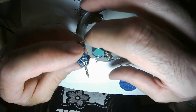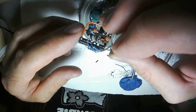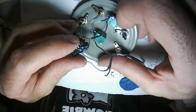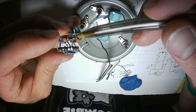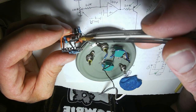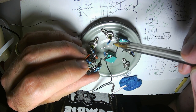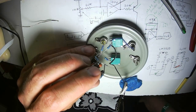Let's connect this little VCA to the circuit. This is going to be ground. This is the inverting input of this op amp right there. So we can put ground to the ground of the potentiometer, put the transistor to the summing point of all three of these 20K resistors. Let's do it that way. Now, this is all very